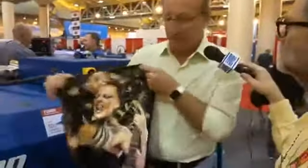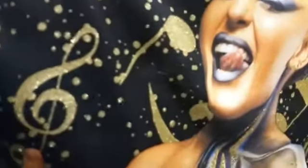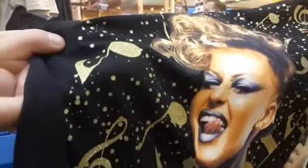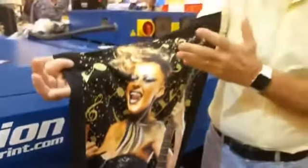And again, 4-color plus glitter. So the quality of the separation is good, but what I want to show is that also the smaller dots are present in the degradation. This is necessary to do, not to show you how to print or how to separate, but to show you the performance possible with the water base.